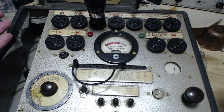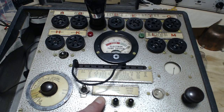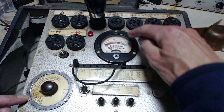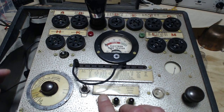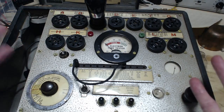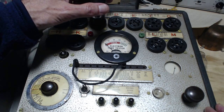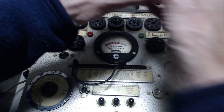It's got to be warm. I don't think there's anything here to warm up — I think it's just a transformer inside here, that's the impression I've got. So we're ready to perform the test already. Holy smokes, did that ever go over! I'm sure I had it in this socket yesterday and the test came up right in the good range. I'm going to push the button and turn this control a little bit. If I turn this up to 74, this may be showing calibration problems with the tester — maybe when it says 69, 74 is a better setting. So I'm going to take out my tube here, which tested good. I have a good 41.